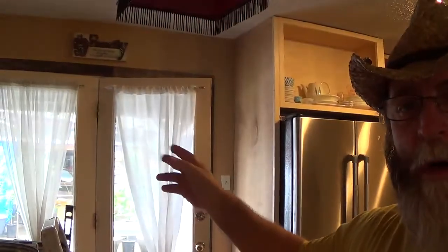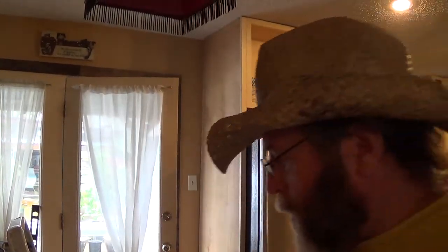I knew that this was 8 feet, and I knew I was going to use this 1x on here. Then I thought, well, I'll put a 1x in the corner, and so that takes a couple of inches off. So I told him, instead of cutting them in half on me, cut them at 94, because this back wall right here, this top section, from there to over here, is 100 inches. I wish I would have had him cut a little bit more off, but I didn't. So I have to make up 2 inches on this wall, or I'm going to have a little piece in here somewhere, or make a seam somewhere in there, and I don't really want to do that.